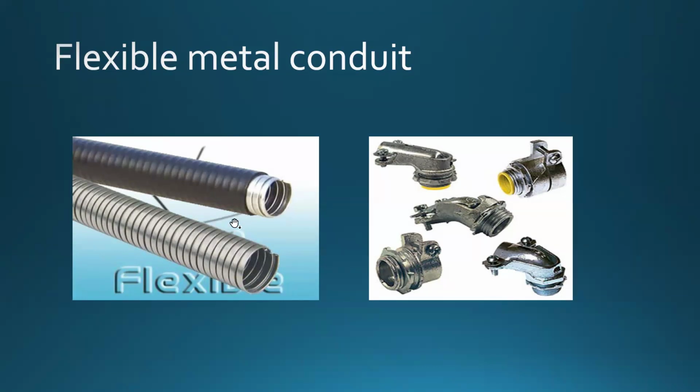You can also get something that's called a direct burial cable, for which you don't need any of the raceway. You can just dig a trench that has to be deep enough, and it will have to do with the deep freeze depth in your area. I think where we are here, is it 4 feet, something less than 4 feet? Or is it 2 feet? I forgot. You have to find out, because in different parts of the world, the deep freeze differs. In some parts of the world, there is no freeze. Right?